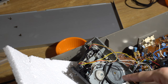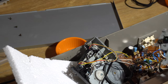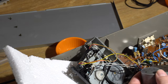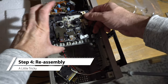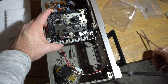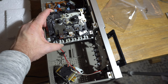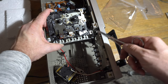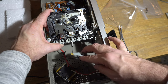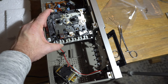What I've been doing is just kind of laying the belt on there and then working this end. One of the things we learned the second time around on the second tape deck was this little notch right here - there's a little notch that you can jam that spring behind, which makes it easier because you've got to basically manage the counter belt, align all these buttons. Also on this deck, rather than trying to bend it down under the record bar thing, I just put it down there so I can go straight down and line up and then put that back in. That second time has gotten a little bit easier.